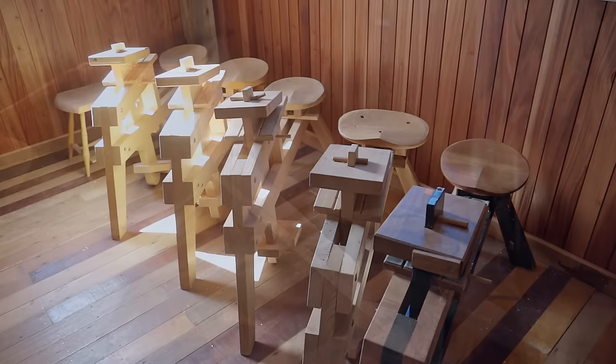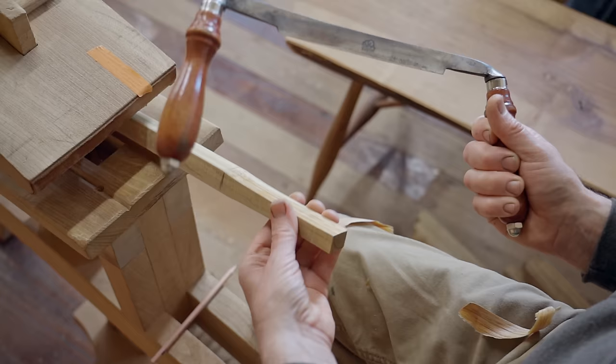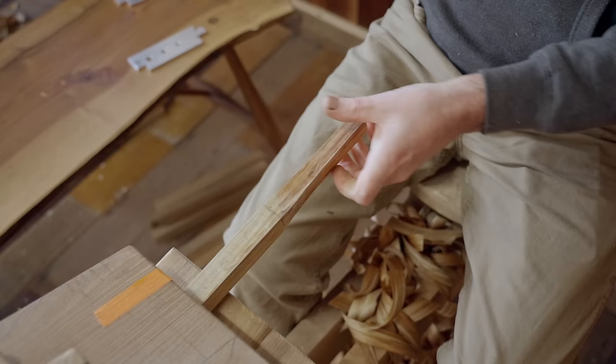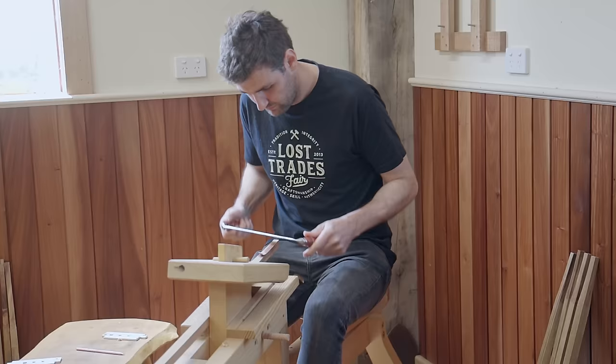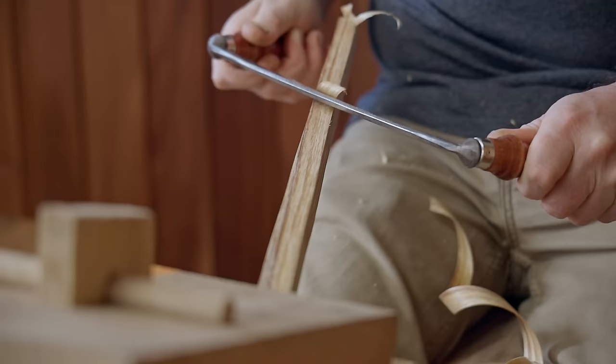Now it's our turn, so we each grabbed a shave horse, which none of us had used before, and started shaving the tapers. The spindles have a swell so far down and they taper down from that in both directions, leaving one end short. We're shaping them square now to keep them consistent, but eventually they'll be shaped round and all done with hand tools.